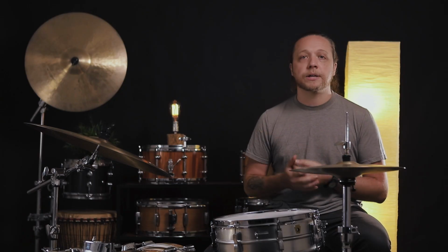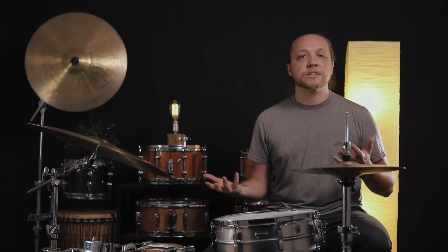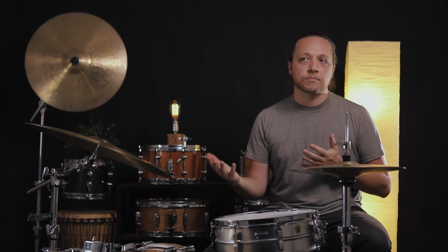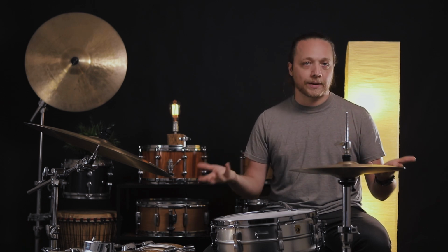When you have a cymbal blank, you're dealing with a piece of metal that's basically been pressed flat when it was hot, but hasn't had any hammering or any lathing done to it at all. We have one here. We're going to hear it in this video. And then over the course of the life of the cymbal, as you're getting it from that into the finished product, varying degrees of lathing and hammering, and sometimes multiple rounds of both, will occur by the cymbalsmith to get it to sound the way that it's supposed to sound.